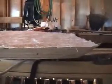All right, let me hop in. I'll show you what else we got. Okay, so we've got a weird lighting thing. We've got the engine, the outdrive, and everything out. I'm trying to step carefully here. I have cut the stringers here. Whoops, sorry. I've cut the stringers to give me lots of room between the hull here to work with, because this is where the new transom is going to go.